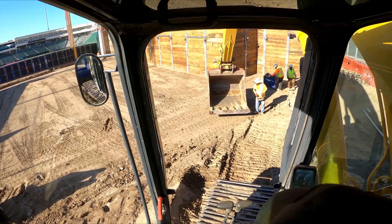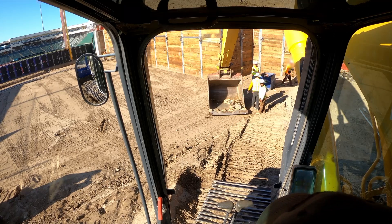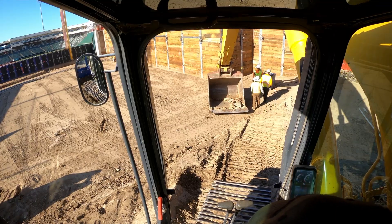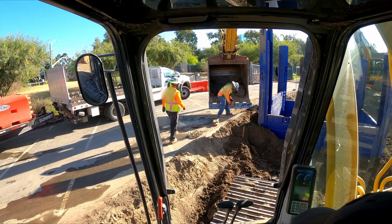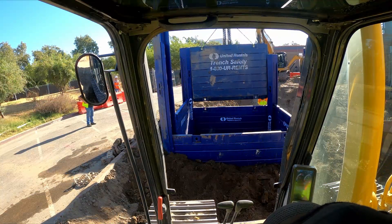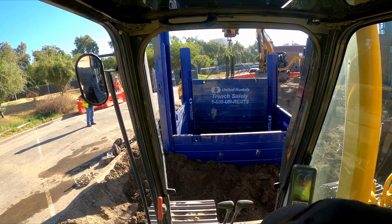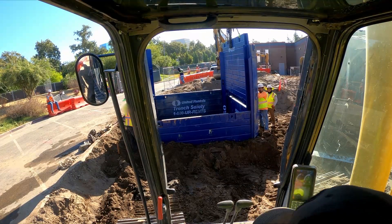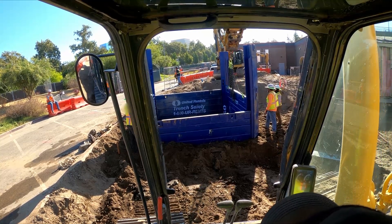Along with your shoring you should receive a box full of all the supplies you need to assemble the shoring system, along with chains, couplers, and anything else required to complete the installation. These couplers are the parts that couple the upper slide panel to the lower slide panel. The reason you need those couplers is because the lower slide panel will eventually drop below the stabilized upper outer panels, and if it drops below you'll never be able to get it out from underneath.